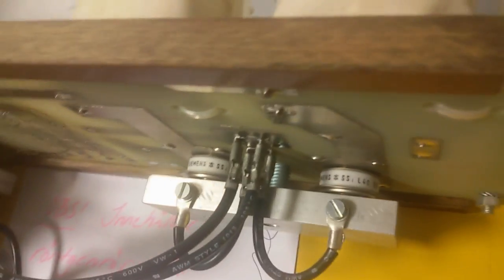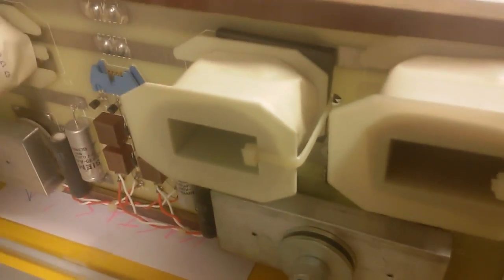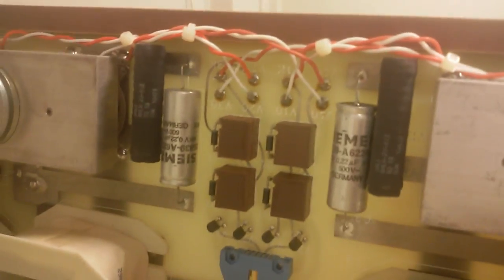And here we got the SCR part out. And there's some, those are diodes. I think they are the SCRs in there. Some more diodes under here. And the SCRs are here. Those two are SCRs, heat sinks. Now I've just turned around so you can see the wires going to the trigger for the SCR. Some open inductors and some controlling circuit of some kind, gate drive transformers.